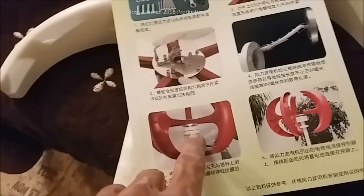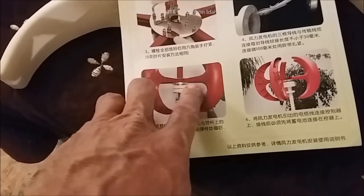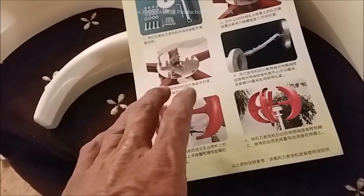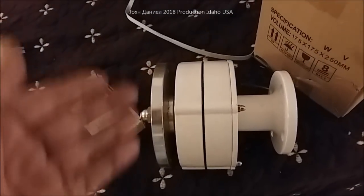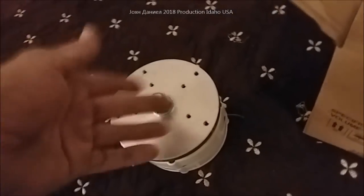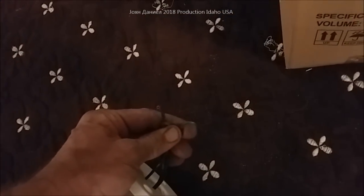Be aware of an eBay trap — a lot of these listings show you a big radial generator, a big flat pancake generator. Those generators will put out the power, but this is a standard PMA, permanent magnet alternator, no different than what's on the front of my currently mounted Chinese wind turbine. Go look at my other videos for turbine wiring, brake systems, and charge controllers. The wiring looks like 12 gauge, so I wouldn't expect anything over 400 watts capacity.